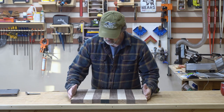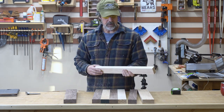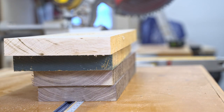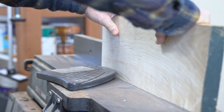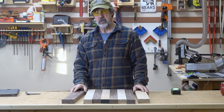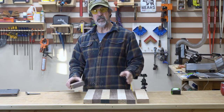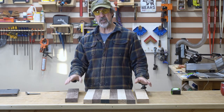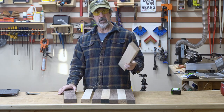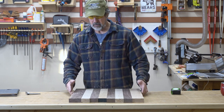I'm checking before I glue this up to make sure there's no problems with any of the joints. To get to this point, I took five-quarter stock - two 21-inch pieces of walnut and two of maple. I ran all four pieces through my jointer, first on the edge and then on the face, then through the planer with the jointed edge down so they're all the same thickness. Then I took them to the table saw, cut them into two and a quarter inch widths, leaving the last piece wide so after glue-up it'll be easier to square the whole thing up.